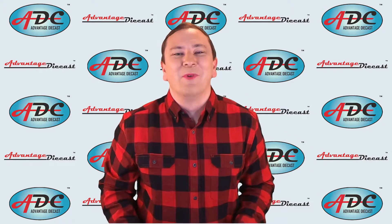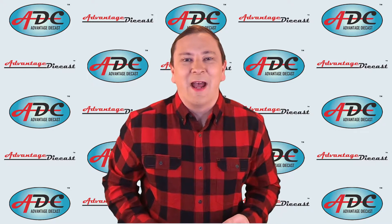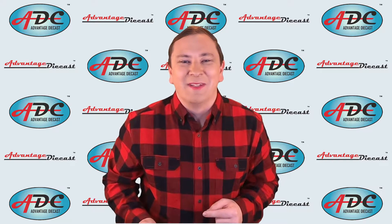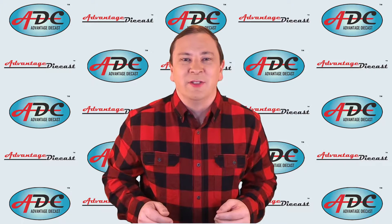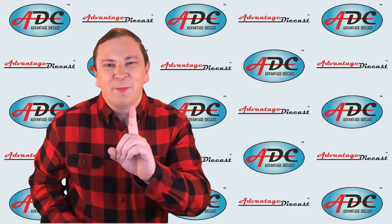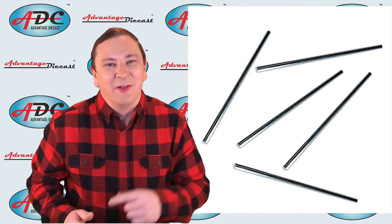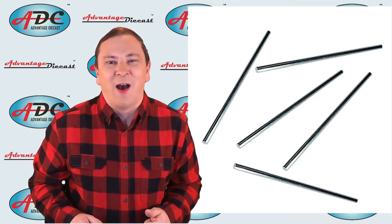It's a little more complicated than that to make a model car. Every part of the die cast model car or truck has to have a mold created. That means if you have a hundred parts that go into this model, you have to carve a hundred mold cavities. Oftentimes that means you'll have to make more than one mold to hold all those cavities, due to the limitations on the size of the actual injection mold machines that the dies go into. There's one simple exception: one part on all models that doesn't actually have to have a mold made, and that's the wire axles for the wheels. But those axles still have to be cut to the exact length — this can be done by hand or automated, but most commonly it's an automated process.